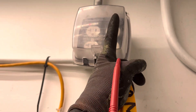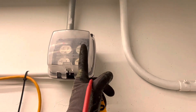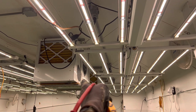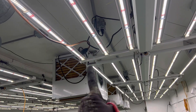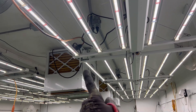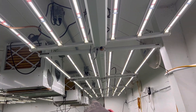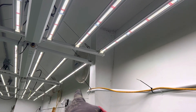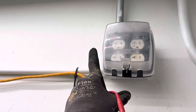This is on circuit number one, this is on circuit number two — they've blown both circuits. First they blew out one circuit, then they took the dehumidifiers, which have motors in them, and put them on a shared circuit. You're supposed to only have one motor on one circuit, sharing with nothing, but they had one motor, two motors, three motors split between two circuits that also had fans and other stuff running on them.